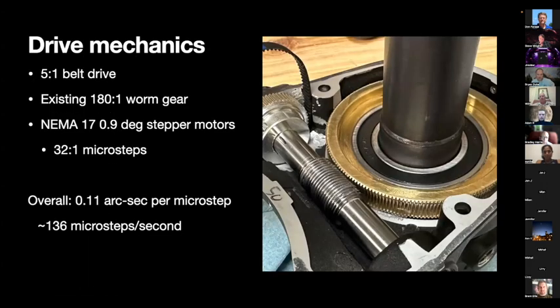For my specific setup I went with a belt drive — you can see the belt in the top left of that photo. The stepper motor goes on the other end of that belt. I wanted the highest reduction ratio I could get, so I went with a 5:1 gear ratio — 12 teeth on the stepper motor and 60 on the other end. That 60-tooth gear was bigger than the CGEM casing, so I did a little machining — by machining I mean I took a die grinder and hacked it away until it fit — and that worked really well.